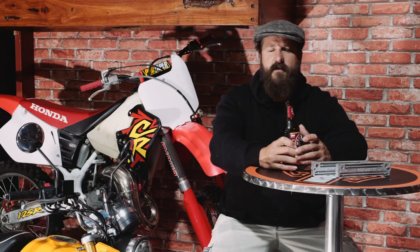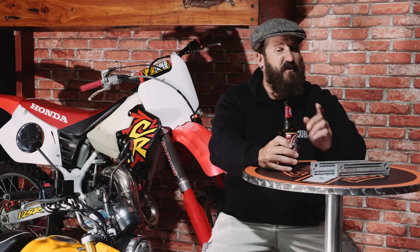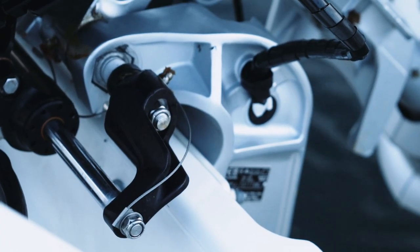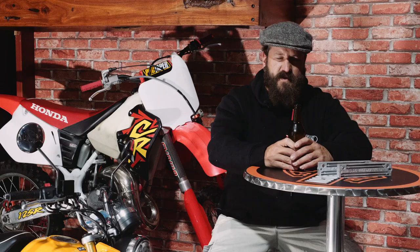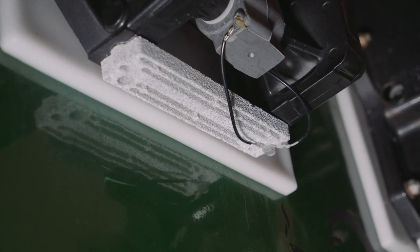There's a few ways to hold on to our ions. One is to make sure everything's electrically bonded. So those little wires you see on your boat sometimes — they're bringing the electrical potential down to the same level. These bonding straps are made from tin, copper, or wire and they form a grounding circuit for all your fittings.